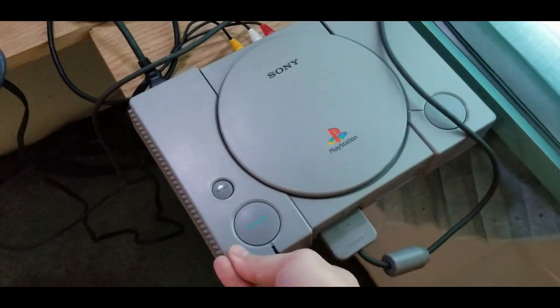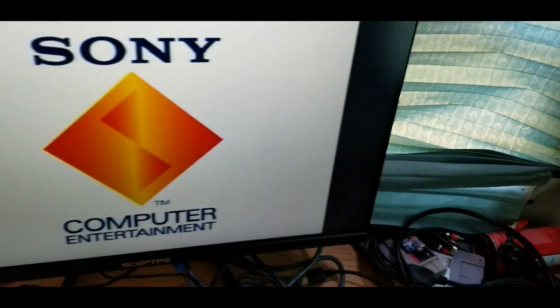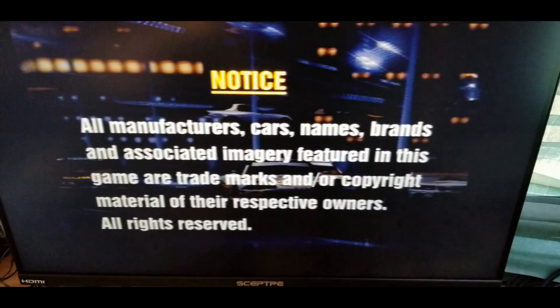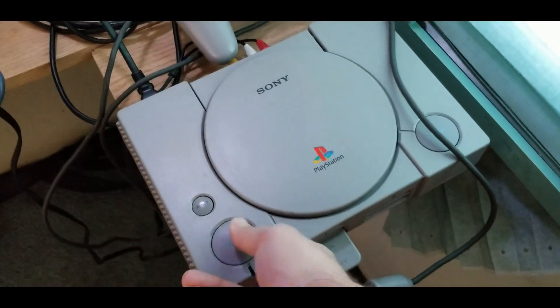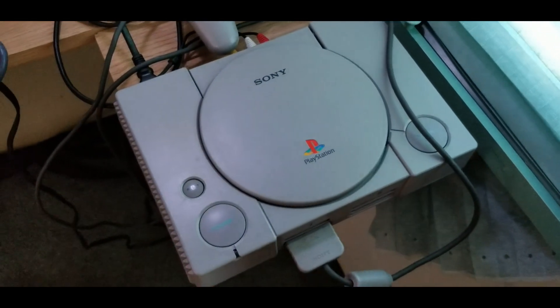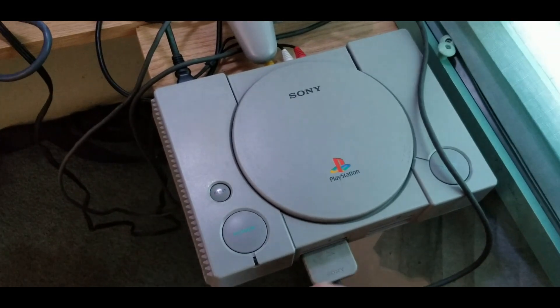Reflowed those two chips. Now we're partially reassembled for testing. Still no music playing right now, as you can hear — or not hear. Originally I was going to replace that RAM chip first, but I'm very doubtful that RAM chip's the problem. So I'm actually going to replace that CD-ROM controller chip.